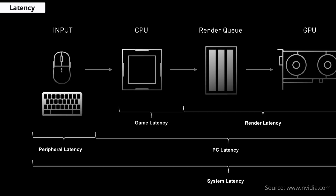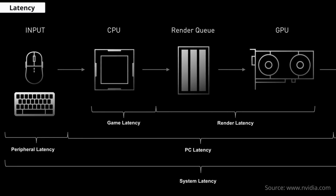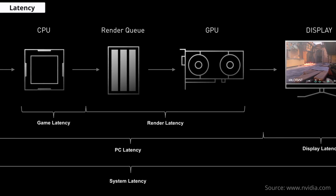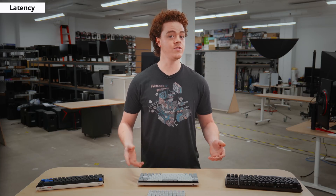Now, to the biggest addition to our keyboard test bench: latency. Strictly speaking, latency is the amount of time it takes for something to happen — also referred to as input lag by many gamers. Keyboard latency is the amount of time it takes for your keyboard to send a signal after a key has been pressed. In any PC setup, every part of the system introduces latency as data processes and transfers. Poor latency can result in a jarring and unresponsive experience, and it starts with the keyboard, since it's the first step in the latency chain of your setup. Measuring keyboard latency was one of the most requested additions to our reviews, so we made it a high priority for test bench 1.0. Doing so without disassembling and possibly destroying each keyboard proved difficult, but we've found a way that requires a lot of tools and math.